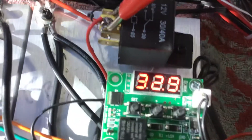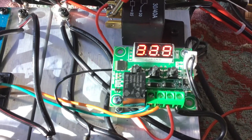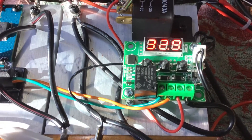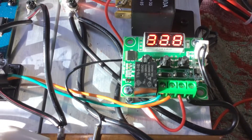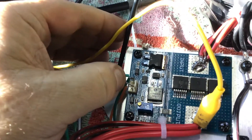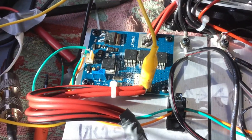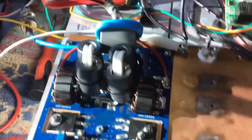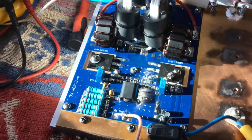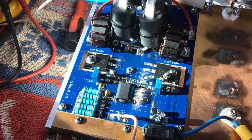Resting temperature is 32.8 degrees. What I've got going on here — the relay on this temperature board, a cheap Chinese unit about $10 — once it reaches the alarm temperature, which I've got set for 45 degrees, it pulls this board to ground turning it off. If you ground the center pin, that shuts down the current protection, which I've got set for about 19 amps.